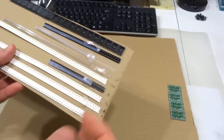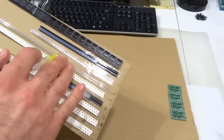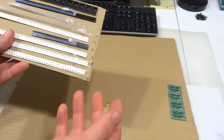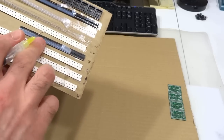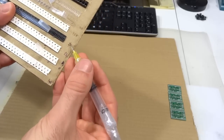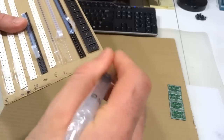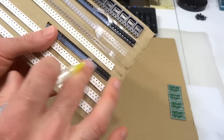I also want to show you this — it's a piece of cardboard that I applied a bunch of double-sided tape to, so the component strips will stick to the cardboard. That way I don't have to mess around with dumping components on the table where half of them will be turned upside down, spending a lot of time aligning and turning parts. It's also very ideal for polarized components like LEDs — I know the LED is oriented a certain way and I can easily pick and place it every time, saving me from having to look through a microscope to figure out orientation.